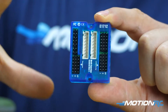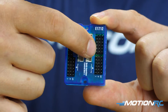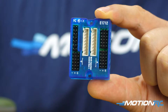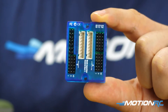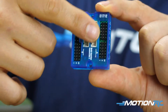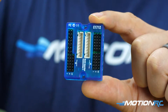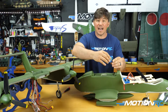The third section is your two big ribbon cables. As it pertains to the OV-10A, both ribbons are going to be for both outer wing sections. Everything having to do with the outer wings - since you can take the outer wing off for transportation - is going to be included in the ribbon cable: a nav light on each side, one outboard flap on each side, and one aileron on each side are all controlled through the ribbon cable.